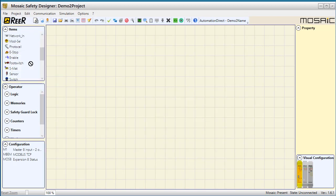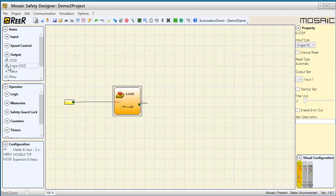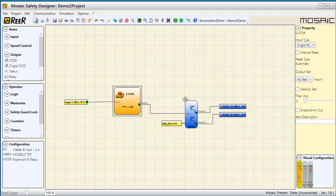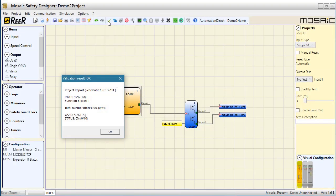Step 2 – Add Components. Let's start with just a single channel e-stop and then we'll switch that to a redundant 2-channel e-stop later in the video. You can then choose the one that your risk assessment requires. And let's add an OSSD output. Step 3 – Assign an input pin and assign the output pins. Notice that both the second output and the feedback pins are automatically assigned when you select the initial output pin. Step 4 – Wire them together both here and the external wiring like this. The e-stop comes in on this pin, the output to the relays is on these pins, and the aux contact feedback is wired to the controller reset pin so it can't reset until it sees the external relays or contactors have actually worked.